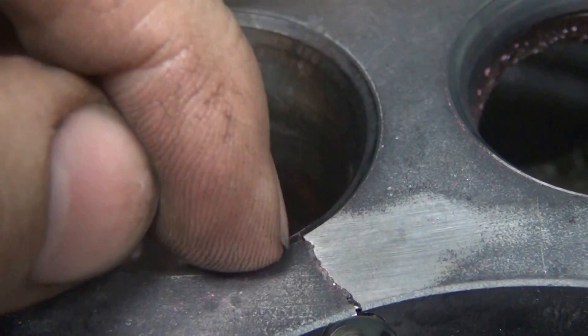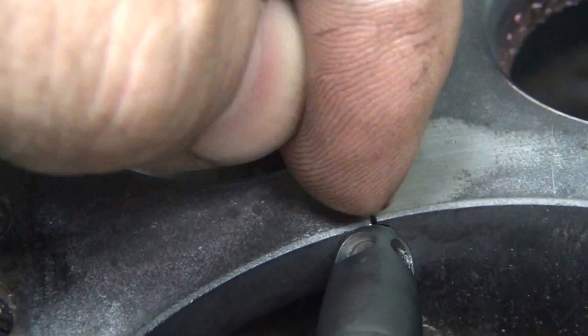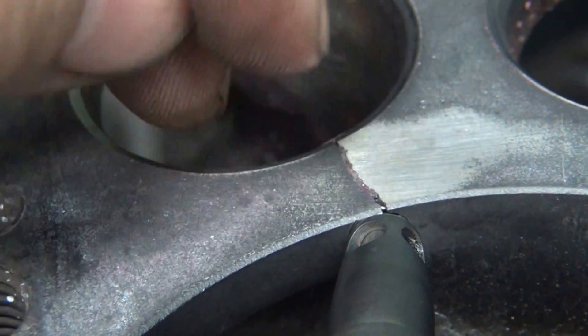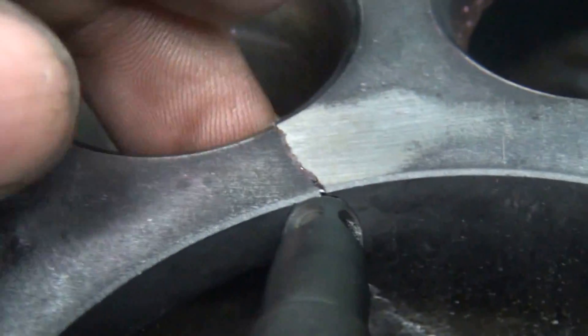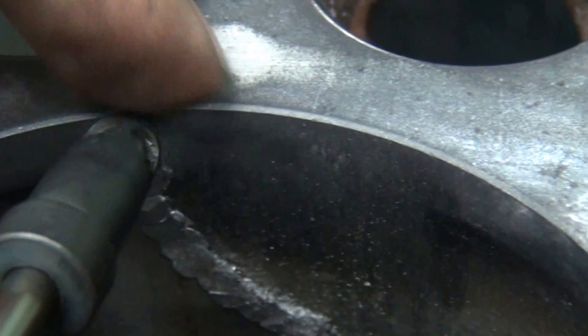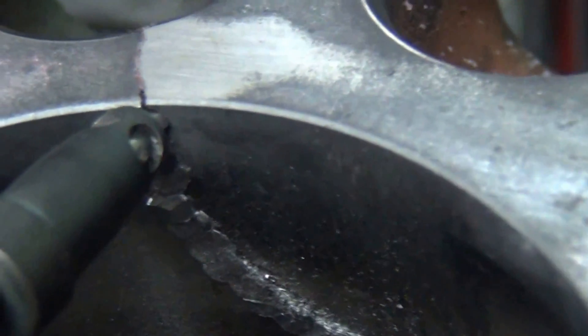You can see how the screw is going straight this way instead of following the crack. These screws on the top — I'll do the same screws while coming at an angle this way here. This first one has to be at a little bit of an angle, then I should be able to go straight in on the other ones. I can't go too straight because I have the other pin on the other side. We will run these along the crack across the top — probably about four of them up there.